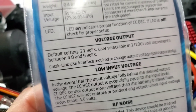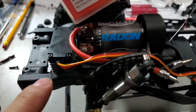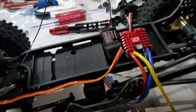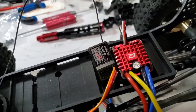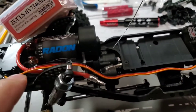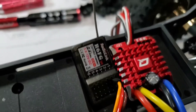If you ever need more voltage, this BEC goes up to 9 volts. Depending on the servo you get, some go way higher in voltage. This one will work at 46 kilograms. So my setup will let me crank up to 7.4 volts, it goes to the servo, and I'll have 46 kilograms of torque.